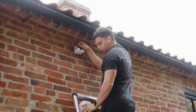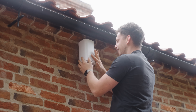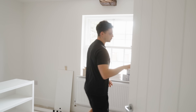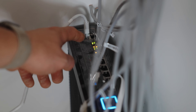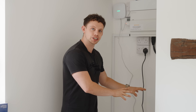I've got the mount drilled up onto the wall and I'm going to plug in one of these Ethernets — it just goes under the ledge, that looks great. With the unit mounted outside, it has PoE, so in here are all of the data runs for this new cottage. There's a network switch down here that runs all the cameras, the intercom, the wireless access point in this cottage, and it also supplies PoE to all of these devices including our exterior ASUS unit. So that thing should now be powered, repeating the signal from my dad's house, and has given this place internet through this switch.